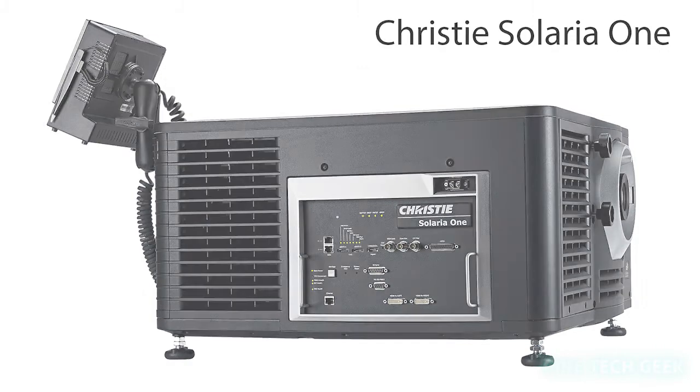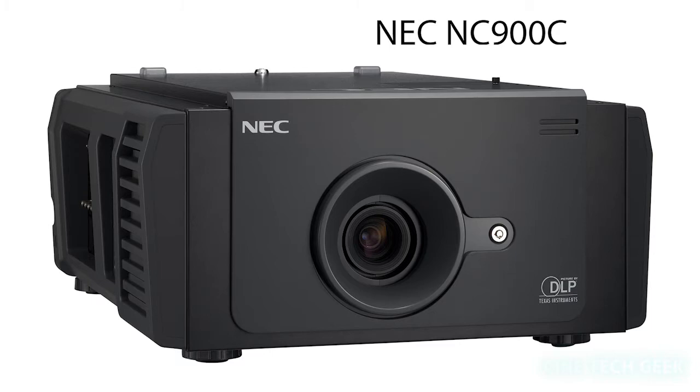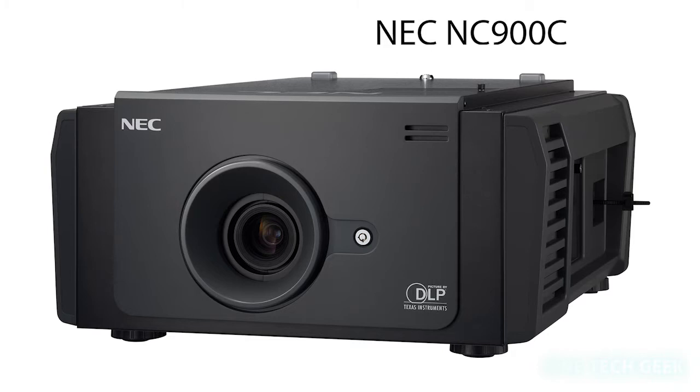Because remember, this projector for $35K includes the DCI media player, and in this case it's an introduction of a new type of media player called the IMS — integrated media server — as opposed to the integrated media block, which still needed an external server. This server has been moved basically into the media block part, so you've got the media block and the small server squeezed into there. That's not actually that hard, because really all it needs is a bit of brains, a bit of CPU, but it's mostly IO — pushing the IO from the DCP stored on the drives into the JPEG 2000 decoder, which pushes it onto the back plane of the projector and out onto the screen. You don't really need a lot of CPU power in there, and they seem to have been able to get over the heat concerns.